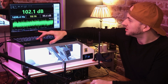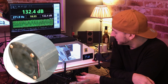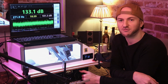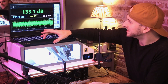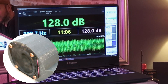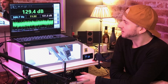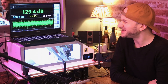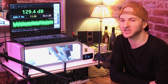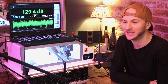Next up, 45 scaled Hz: 133.1 dB. Again pretty flat. And lastly 60 scaled Hz: 129.4. Relatively flat overall, but it doesn't have that massive peak at 25 scaled Hz that the other enclosures we've tested have had, so that's going to really drag it down in the averages.